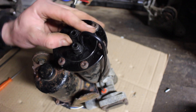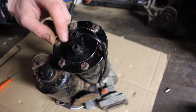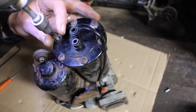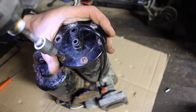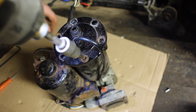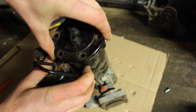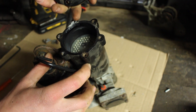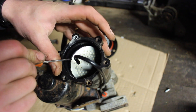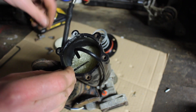I'm going to take off the back cover of the dryer housing — this is something I replaced a couple of years ago with an aluminium one, as the plastic one that comes from factory used to split between the inlet and outlet and cause an air leak. These are six T30 bolts. So inside we have a spring, our first filter pad, behind which is our desiccant, and now the desiccant beads.